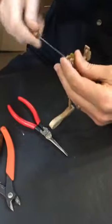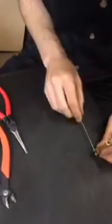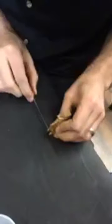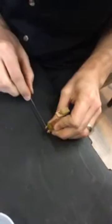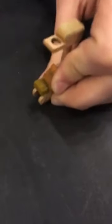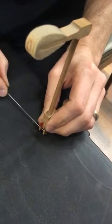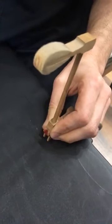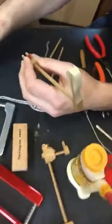This one, I'll go in maybe a little bit more. It's nice to be able to go back and forth, but you always risk pushing that. You feel on your lip right here, if it's heated, then you're good. If you're generating a little heat, that means you're ironing it, which is what you want. So that first one cuts the felt, and the second one irons it, and yeah, I've got a little heat.